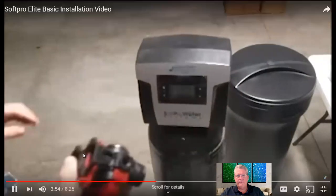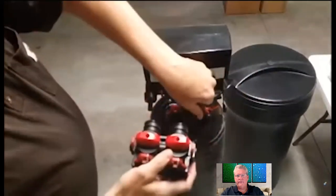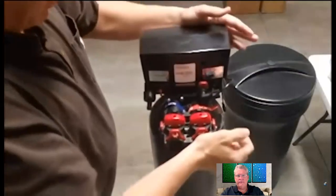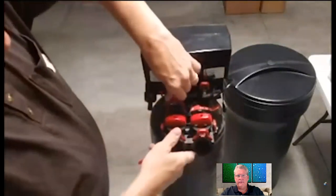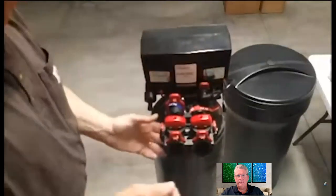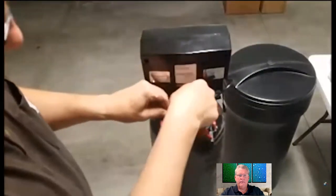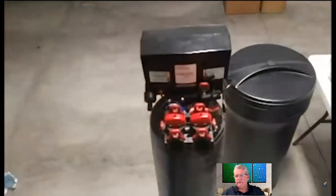While we're here, I'm going to turn this around — here is the bypass valve. I'm going to pull these two little clips off, take the bypass valve and slip it into position, then slide the little clips right back down on top. You heard that snap into place — the clips snap into place, and that bypass valve is that easy to connect.